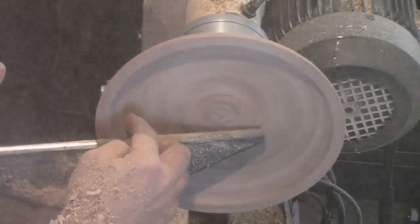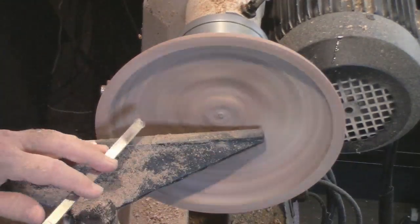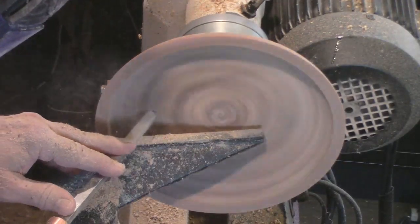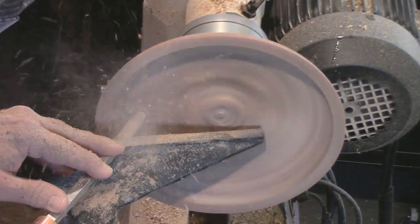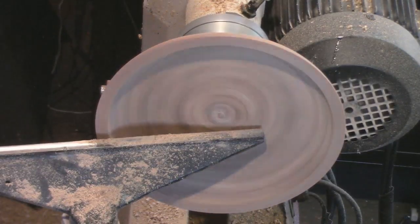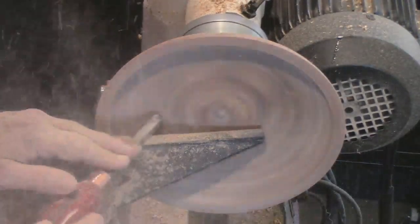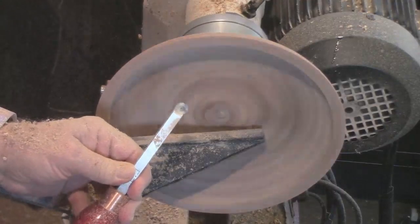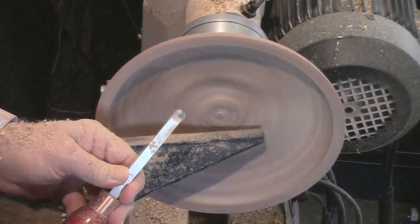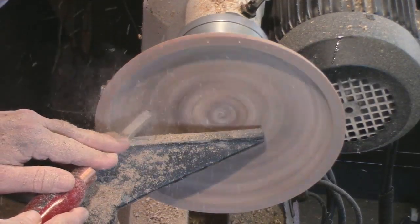So I'm finished from here, the top to here. Now I'm working from, say, here to here. That section right there. Working my way down the stages. I'm wondering if I have a wrench handy. I probably don't. I'd like to rotate that cutter. Let's try a different one. That one may be getting a little dull. Let's see if this one's any fresher. People always ask with the carbide tools, how do you know when they're dull? And my honest but seems smart alecky remark is they don't work as well as they used to. Then it's time to either turn them or change them.